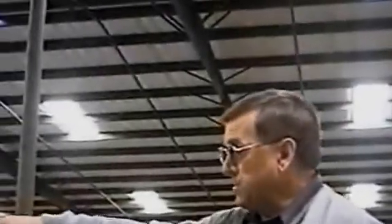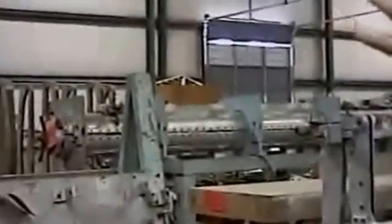Yeah, it's a quarter inch or 3/32 honeycomb core with an overlap, right? No, it's just a quarter inch plain aluminum sheet formed with the joggle in place because it overlaps the expansion on one end. So they're located there, taped in place with adhesive tape, and then the pressure is applied by air. See the ends? I came up with that expander. You turn it and you expand the end, make it round during the bond cycle. Because it's not perfectly round when it gets to that point. Or to keep it round, let's say that.